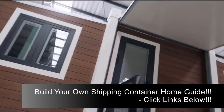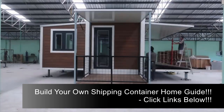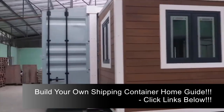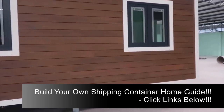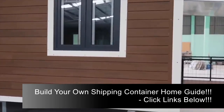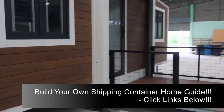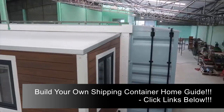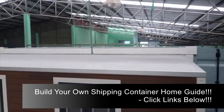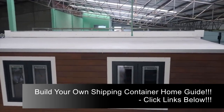Bigfoot is made from a 20 foot high cube shipping container. It has floors, walls and roofs that fold out from both of the long sides to transform it to approximately three times the original container's footprint. The folding walls and roofs are made from SIPs, or structurally insulated panels, sometimes referred to as sandwich panels. A polyurethane foam core wrapped in sheet metal forms each individual panel, and those panels interlock tongue and groove style to make the walls. They are in turn wrapped in a steel frame to form a remarkably strong and well insulated structural roof or wall, achieving an R14 rating.